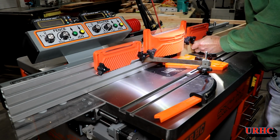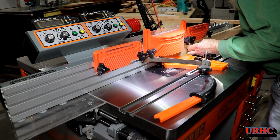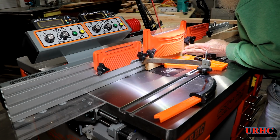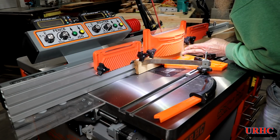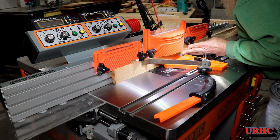And it turns out that the lead screws don't have enough friction in them to stop it from shifting with all the vibration on a cutter this big. So I'm going to be doing some rewiring to keep them locked in position, and I don't care if they get a little bit warm, but that'll solve my problems.